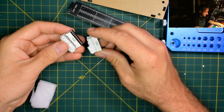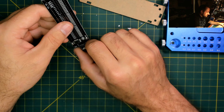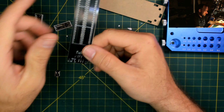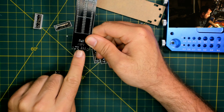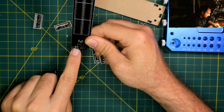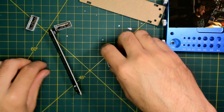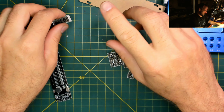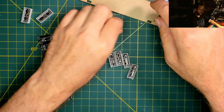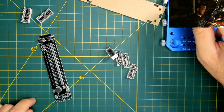Oh, this is nice. These actually say red and these should be blue. Yeah, they said blue. What I will be doing, however, is having pins. So I'm going to put some pinouts here. We do have R, G, L. G is common ground, L is left, R is right, and then we have ground and voltage. So we have 5 volts in, which is good because that's what my buck converter's at. I may actually change my buck converter from the charger to this, and I do have a 24 volts to USB car charger that I might use for the charger itself.